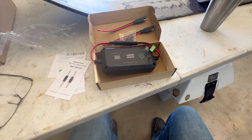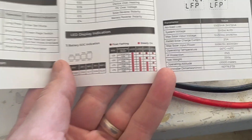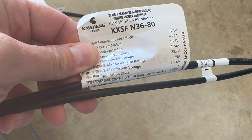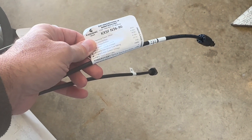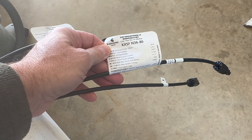I've opened this up and it's a pretty nice little low profile unit. It says 12 volt, max is 30 volt open circuit. My solar panel is open circuit 23 volts, so I'm below that. Rated current is 20 amps. If I hook two panels up, it's 5 amps for one and 10 for both — so I'd be at about 8 amps, well within spec.